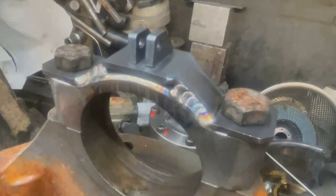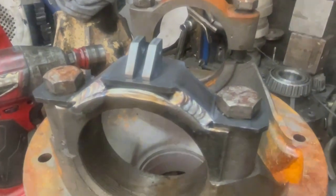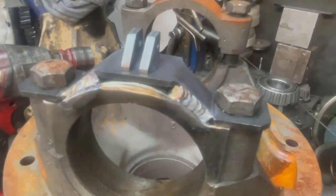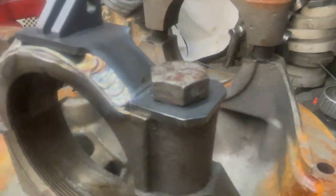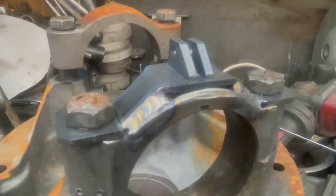Our CNC plate is clamped down with the normal bolts and then tack welded in four places. We've made little grooves in the side of the plate so we can tack weld it into position. The material is Domex 700MC — an amazingly strong, expensive special steel. At 3mm, it has three times the structural strength of mild steel, so that 3mm is like welding 9mm of plate on. The top pieces welded in from underneath are 4mm, equivalent to 12mm towers. This is incredibly strong. We do some tidying up to make them look presentable — because we're a bunch of tarts here.